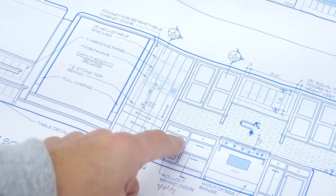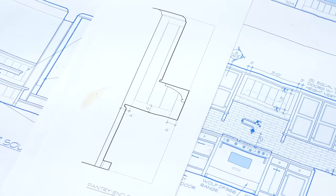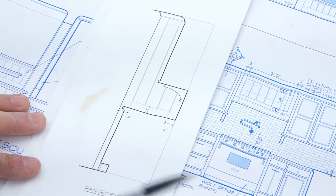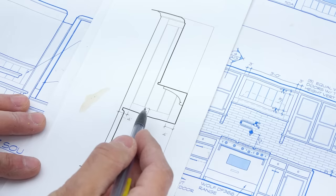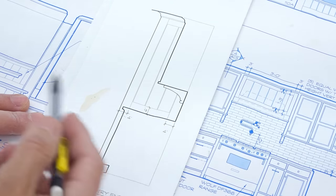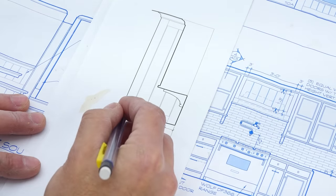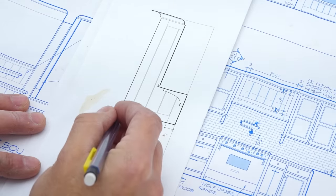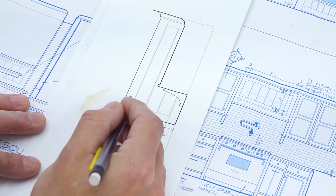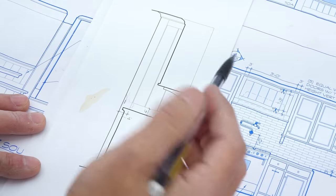The face is going to be touching the other cabinets. That's a view of the side panel that's going to go there. So the only thing we need to consider here is the show. We talked about this before with the side panel for the buffet cabinet. So this front one is going to be lapped. So we're going to take away the thickness of the face frame from this one to get our 4-inch show. So the stile on this panel is going to be 3¼ wide.